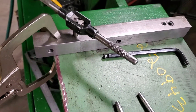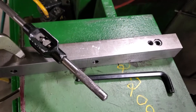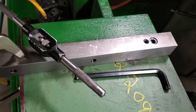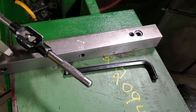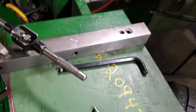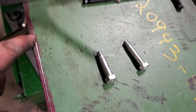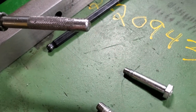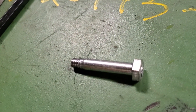That's a 1-and-a-quarter inch block — you can use anything you want. It keeps your drill nice and straight, so you initially drill a quarter inch hole. Then I went back to the mill; I had it still set up. Once I got the quarter inch hole drilled in here, I drilled 5/16ths holes there, and then used a pin to locate — basically a bolt.